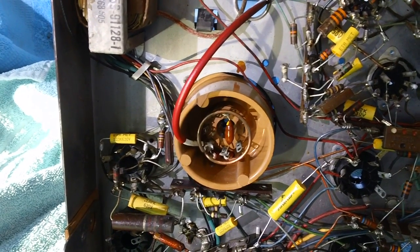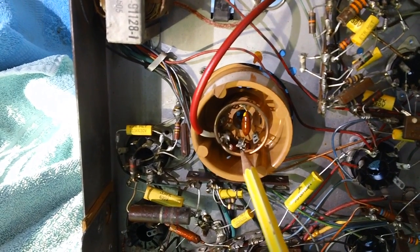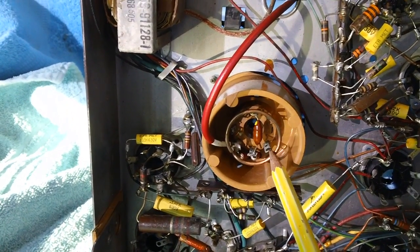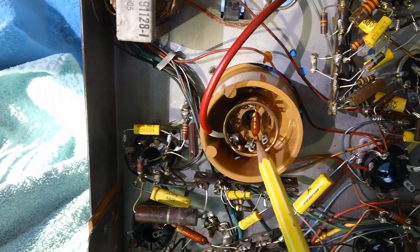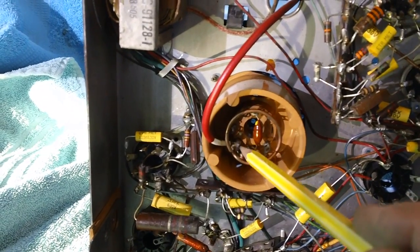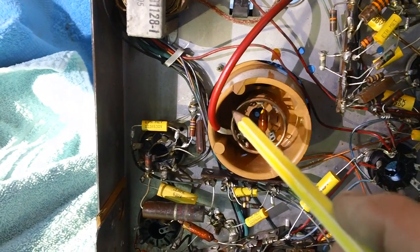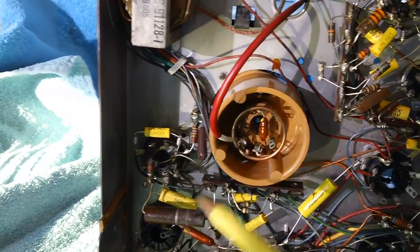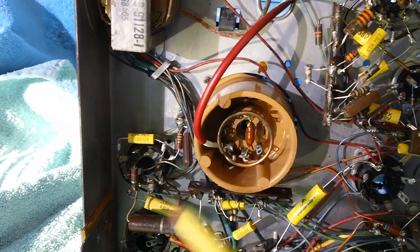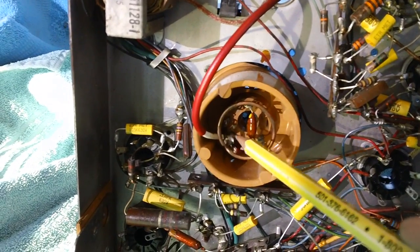And it says that the ring, being round wire shaped in a circle, allows the electrons to pile up evenly along the ring itself. Its smooth edges never reach enough potential at any single point to arc into the air. How about that? It allows the electrons to pile up along the ring from here, and they can't arc across into the air. I imagine if you went high enough you could, but the voltage in this set, I imagine it would probably melt if it got too high. Anyway, that's what the ring does. It allows the voltages to pile up here without arcing into the air that you would normally get without it.